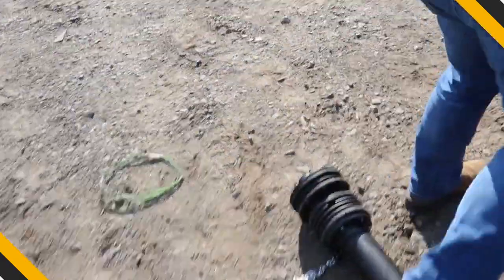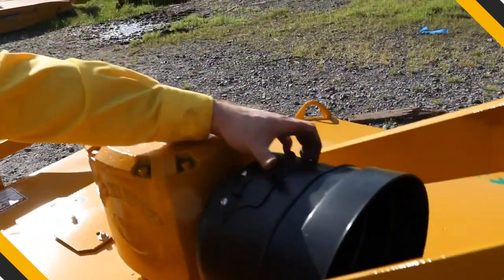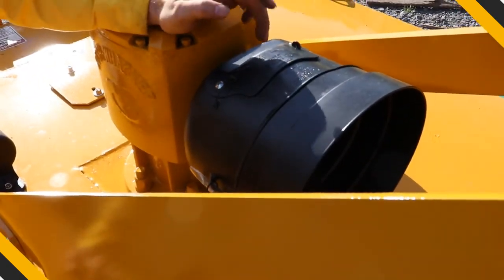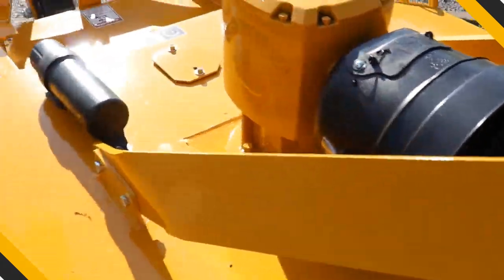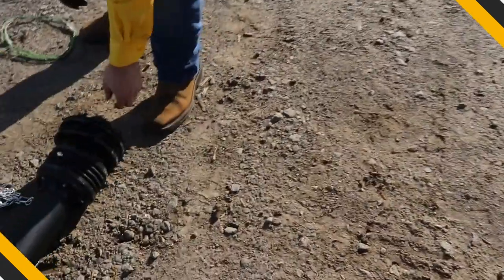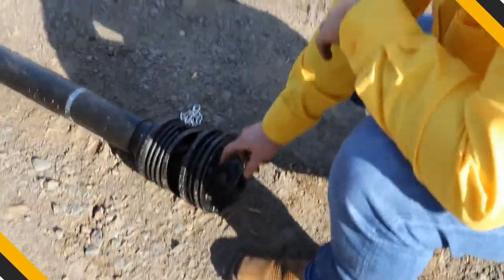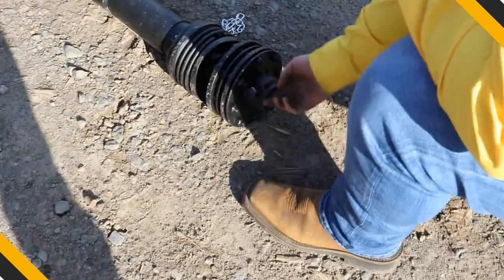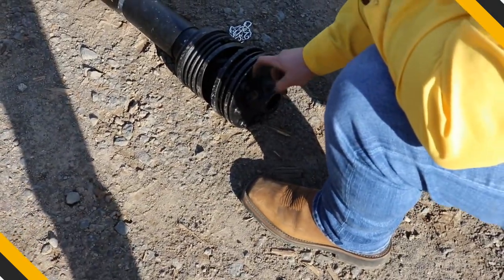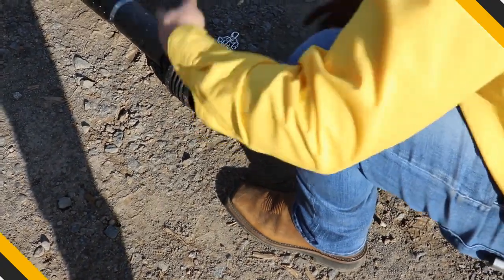On the backside, if you look here on this cover, it's got a Phillips head screw. You remove this plastic cover right here, which gives you access to the input shaft of this gearbox. You do the same thing — you line up the splines, and on the back of this it has a tapered wedge bolt with a washer and a nut on the threaded side. You line those up; there's only one way this pin will go in. Once you put it in, you tighten this down and you're ready to start cutting.